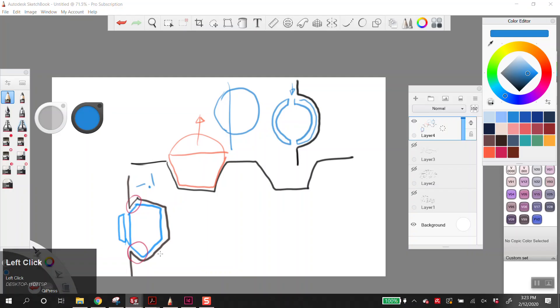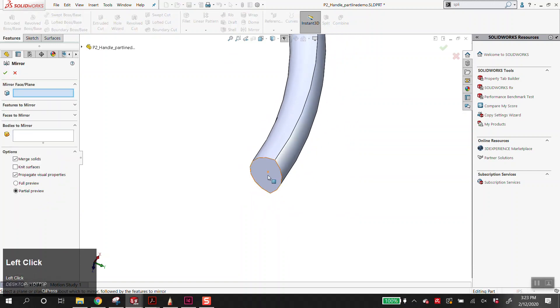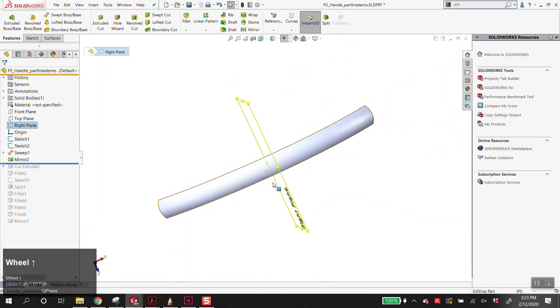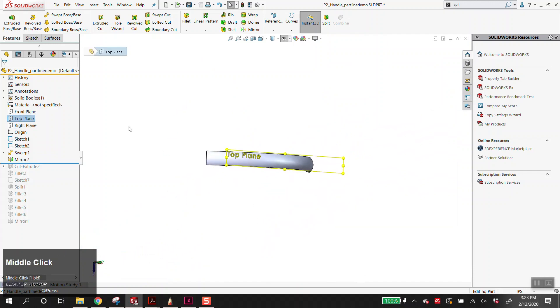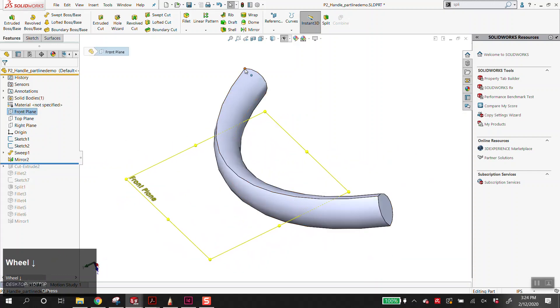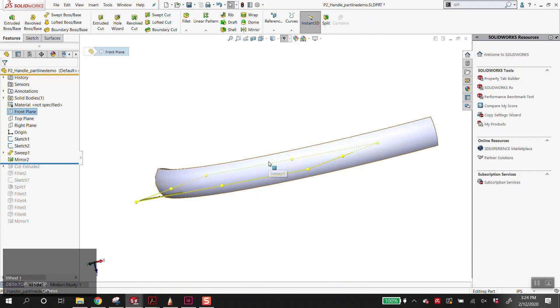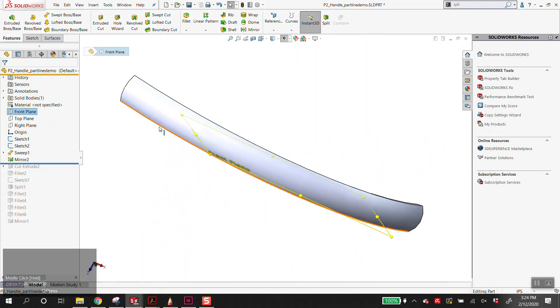I see what you're saying — if we go back to here and simply just mirror this, are you saying to put the part line right there, or lengthwise? That would work too — that's fine. I have often seen it done along this edge because then the part line will be in the middle. That's not wrong — I've seen that too. As long as it's somewhere logical, that's all I care about. Good question and good point.